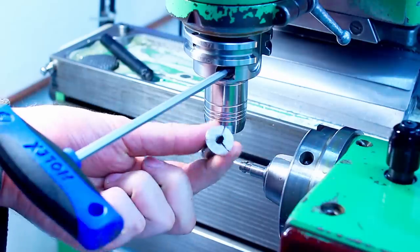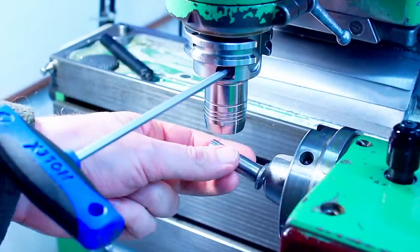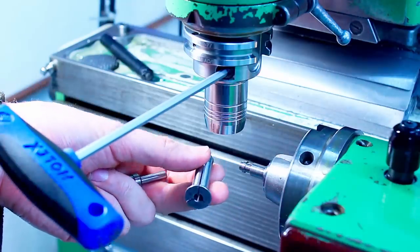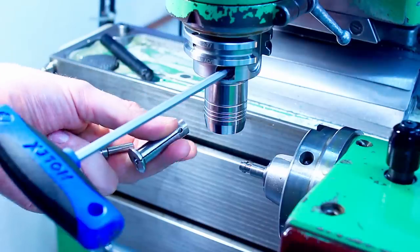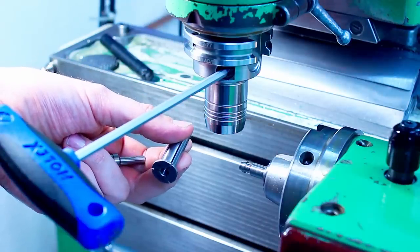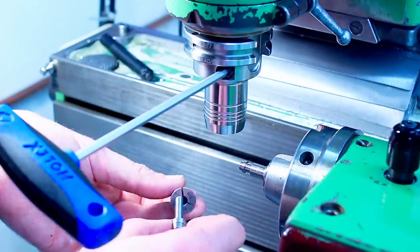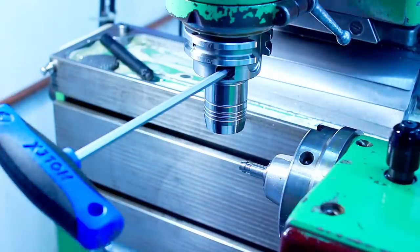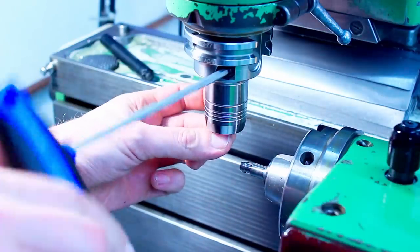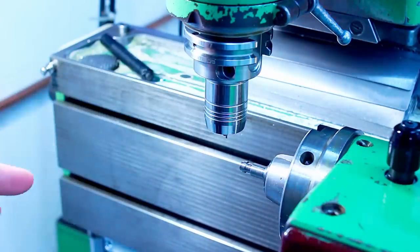And you can sleeve them down with these straight shank and straight bore sleeves. These are not collets, they are just sleeves to reduce the diameter. I find this hydraulic chuck to be an excellent quick change tooling system. I can change between a sleeve with the edge finder now to a sleeve with the small trepanning tool that we need very fast. Just tighten it down a few spins with the hex key and you're good to go.